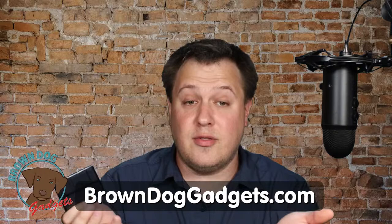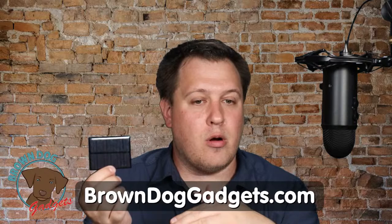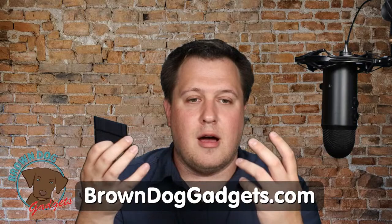That's why any 12-volt solar panel you buy for putting on a house or in a system is actually rated 18 volts. Because that way, if the sun dips down in power throughout the day, you're still above that threshold. And even some systems where they'll go up to 24 volts for a 12-volt system just to prolong that extra hour between the morning and the evening of solar energy.